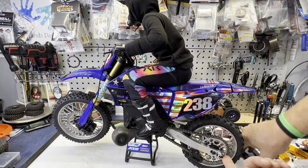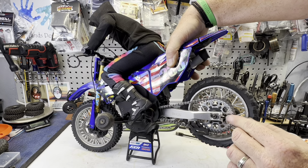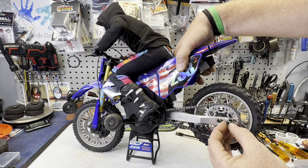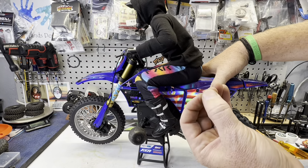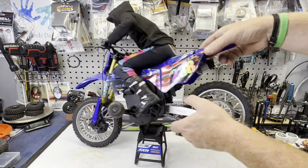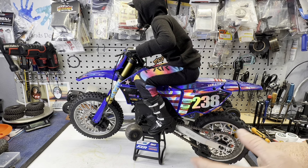This could be a potential point that you're hitting on stuff, but you're going to hit the chain or sprocket more than likely before you really hit that screw. I was playing around with putting the nut on the inside here and just using an M3 screw from this direction — I think that would work pretty well. You'd just need like an M3 by 10 or 12 probably so it doesn't get in the way of the nut on the back side. But I'm going to run it the way it's meant to be ran.